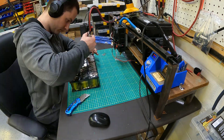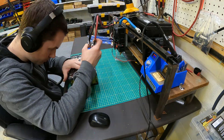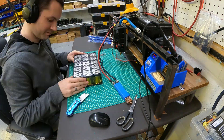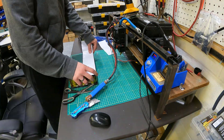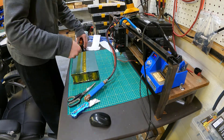You can do this with wire or with spot welding. Spot welding is a little easier for us, but each of the ten connections need to all be connecting on each battery pack. This is pretty simple — wires or spot welding will both do, and these tabs do not have to flow any current. They're just parallel tabs.